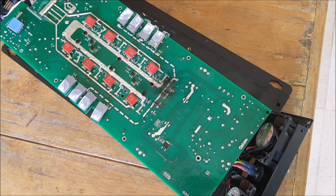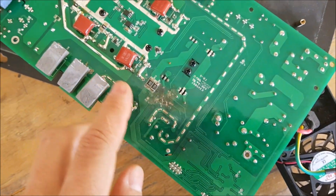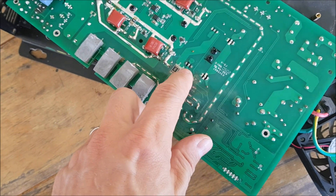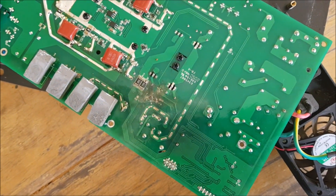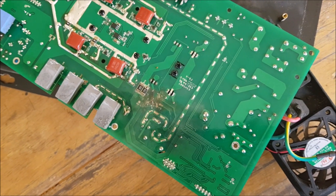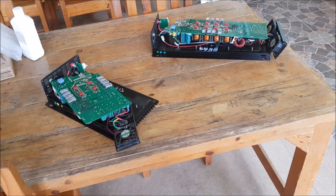This will be a donor board for the 1000-watt inverter. Let me show you what happened there — kind of a similar picture, unfortunately. Also an area where something blew up. There is also a transistor here, but the color from the solder changed and the traces seem to be good. I will clean up the board just to see if there is anything going on underneath the smoke, and I hope that at least the 1000-watt inverter can be saved. The 2000-watt inverter — I have already ordered a new one.